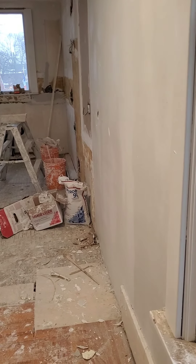First we'll Sheetrock 90 that area, hit it with mesh tape, then come over and Sheetrock 90 all of these corner beads. After that we'll bounce back into that room and put another coat of Sheetrock 90 on that until it's true flat. Then we'll bounce back here and get the white mud — the finishing compound — and do a coat right over top of the Sheetrock 90. By around lunchtime it will be set up enough, so everything will have the actual first coat on it tomorrow and be ready to start pre-sanding and the finish coating process the next day.